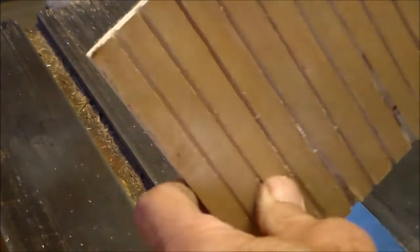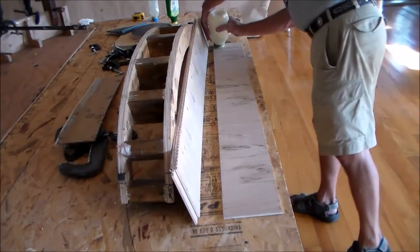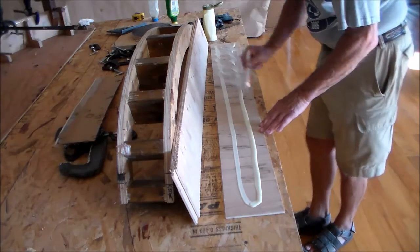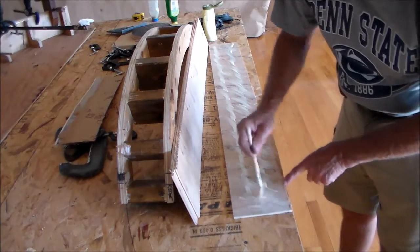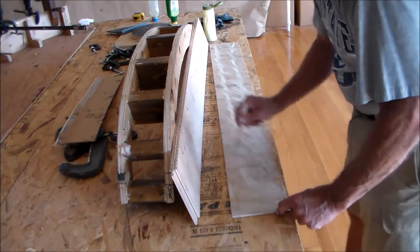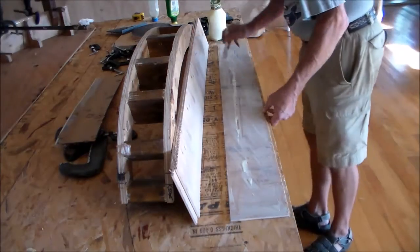You can see here that the kerfs will allow the plywood to bend. I built the glue-up jig to bend a double arc in one glue-up, so the glue-up jig is six inches wide. This will allow me to split the glued-up arc and have two pieces that will finish at two and a half inches wide. Four quarter inch sheets of plywood are being glued up — the three outside sheets have kerfs cut in them, and the inside sheet is clean, so that I don't have grooves on the inside of the arc.